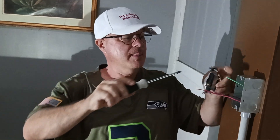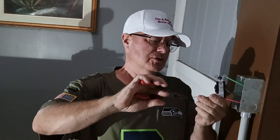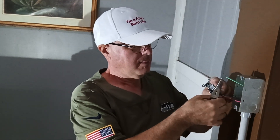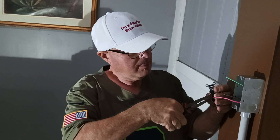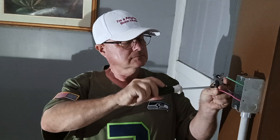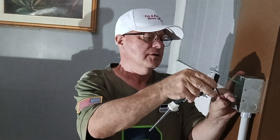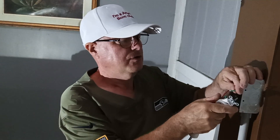Close it the way our screw turns, nice and tight. Put it around and put our other wire on the screw here — you always make your loops the direction your screw turns. Make sure we don't get our insulation caught under the screw head. We'll get our red and black in like this, and now we'll put our green wire around our ground screw here.